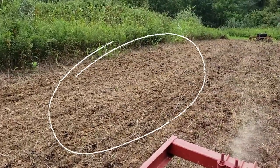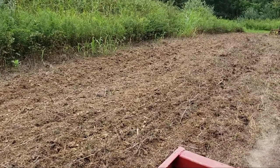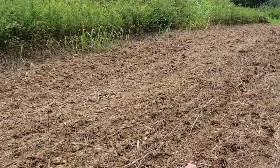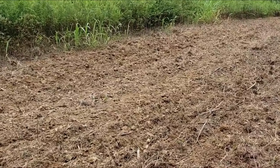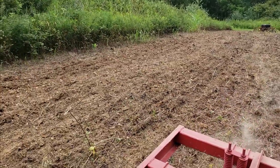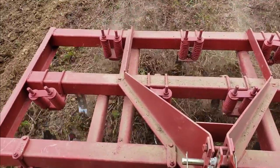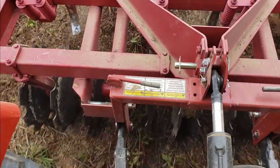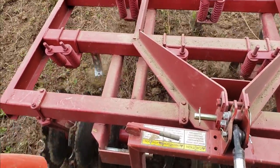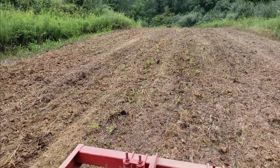Look right here — that's two passes with the draft control set, and without the draft control I could never get it to cut like that. I only cut the top two inches, this is ready to plant right here. You've got nice one to two inch furrows and nice loose dirt — and matter of fact, Curtis did plant it two days later without having to do any more field work. So that's the draft control. Hopefully it made sense. I appreciate you guys being on board — let me know what you think in the comments and we'll catch you on the next go around. Thanks.